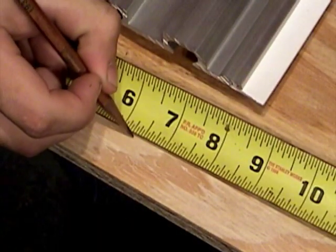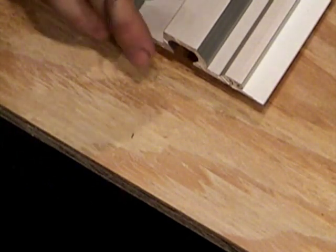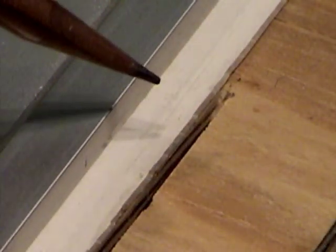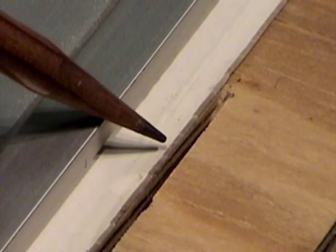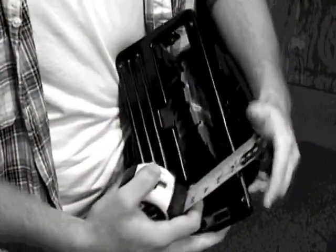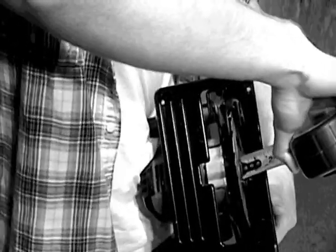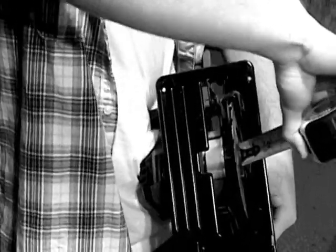To align the rail, just draw a location mark at each end of your cut, position the non-slip polyvinyl track edge at your two marks, and make your cut. The edge of this strip will always show you exactly where your cut will be, so you'll never again have to factor in your blade's offset to compute the position of each cut. Talk about simple.